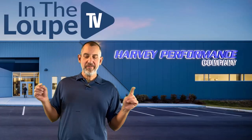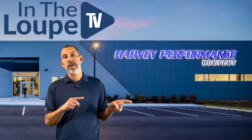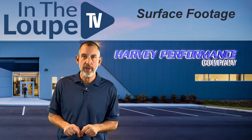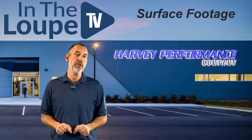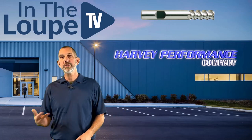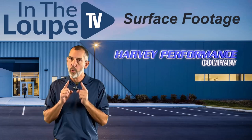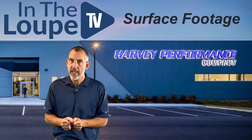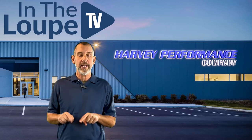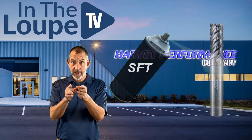Hey folks, thanks for coming back and I apologize for that gentleman a little bit earlier — he can do his show when it comes around time for him to do his. I love talking about surface foot. I think surface foot is very misunderstood when it comes to cutting tools, whether you're using a drill, an end mill, or a reamer. We need to understand it a little bit better, because once you do, you can start using it more effectively. There are also some things going on with surface foot, especially with new toolpaths, that could be killing your tools.